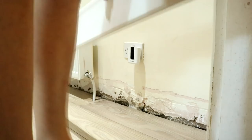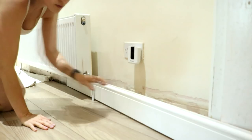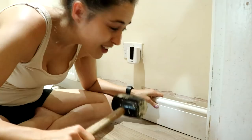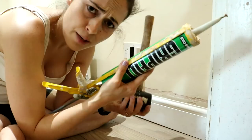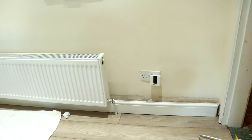There's no chance I'm going to glue this board first — it's just touching too many door frames trying to get it in. I finally managed to just get it in with a mallet. I can probably see why the builder only put dabs. I'm going to try applying the glue on an angle onto the skirting board and probably the wall as well.